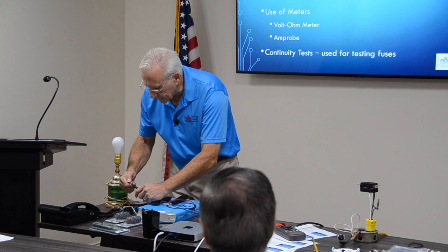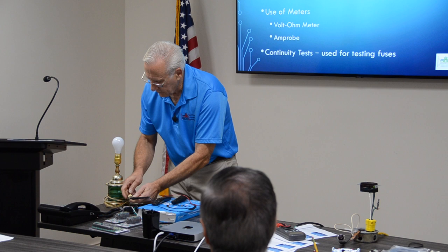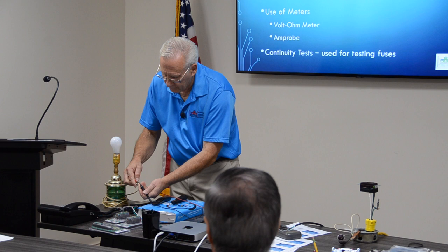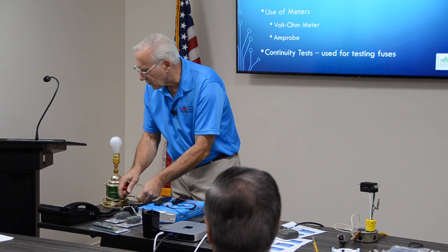Did I leave that on or off? Okay. That's just prong to prong. Now, what should I get? Nothing. Because the bulb is out. There's no complete circuit anymore, right? Okay? Simple. I mean, you can test light bulbs like that.